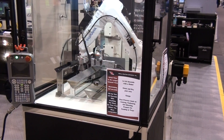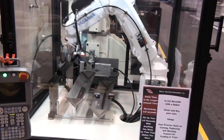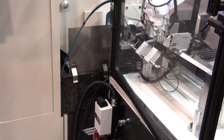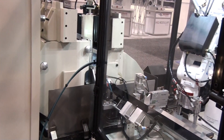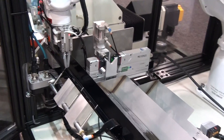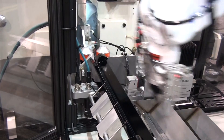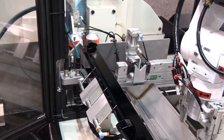The larger machine has robust spindle and bearing design for accuracy and long life. The machine sits on our 8 inch thick Starrett surface plate quality granite. The 2 tenths flatness specification forms a perfect platform for such a robust spindle design. The granite, known for its rigidity and thermal properties, provides greater coolant containment with its steep trough, compared to other machines on the market that have thinner cast iron beds, making it as strong as those with machine platforms twice the physical size of the TG12x8.